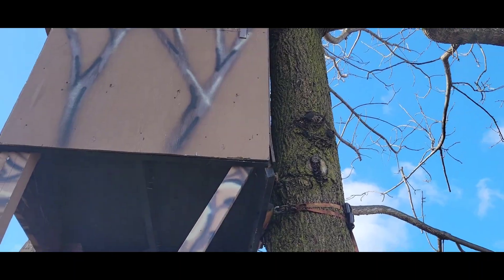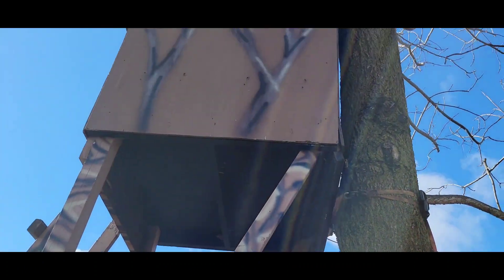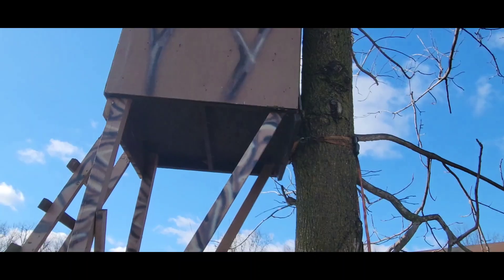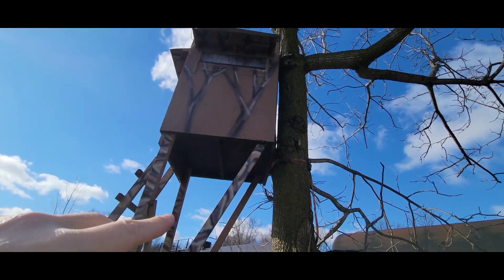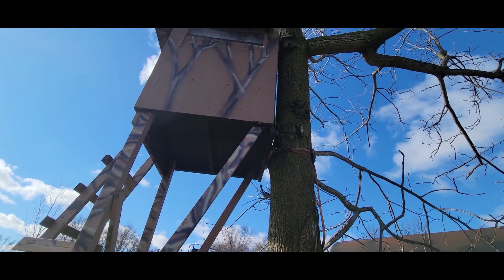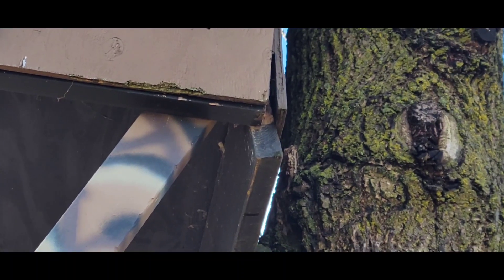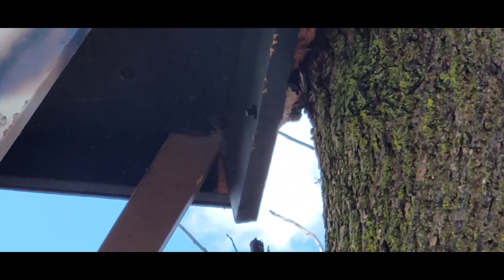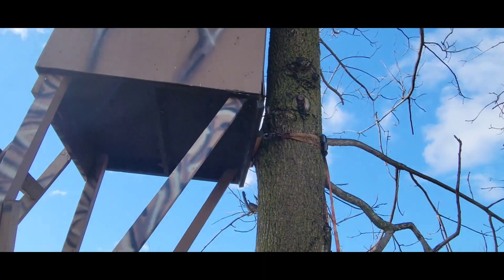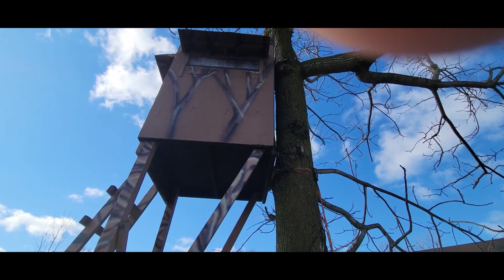You can see I'm tied to a tree. This is a two-legged stand — we're going to make it a four-legged like the rest of ours, and we're not gonna rely on a tree. When trees grow, they start pulling away. Zoom in a little bit — see how it's pulling away the frame right there? I'm anchored there with straps and it's pulling that two-by-six away. It's still solid enough for me to get up there and take it down, but no more tree box stands for me. Too loud when the wind blows.